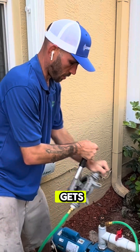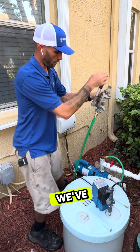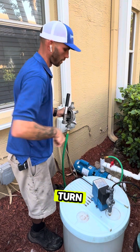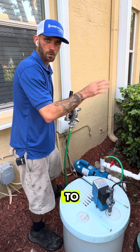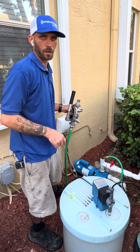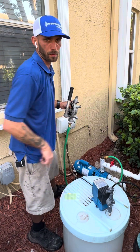You can feel it when the water gets close — and there we go. Now that we've got water all the way to the head of the pump, we'll go ahead and disconnect the hose, turn the pump on, and allow it to pull out all the air, because that is a self-priming pump. But we don't want to burn it out trying to prime the pump all the way from the bottom of that well.